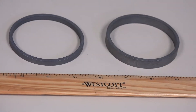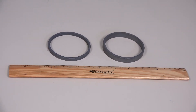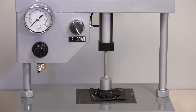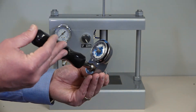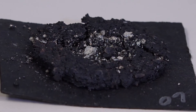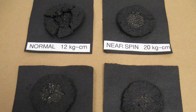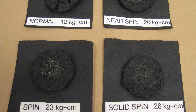Samples are made in a similar fashion to the wet track samples but with smaller templates, and allowed to cure — usually for 30 and 60 minutes. The tester has an air pressurized cylinder that puts a controlled amount of downforce on the sample. The technician then exerts torque using a torque wrench in a controlled twisting motion on the shaft of the tester. The torque reading is recorded along with an assessment of the tested sample, giving a prediction of return to traffic times after the mix has been laid.